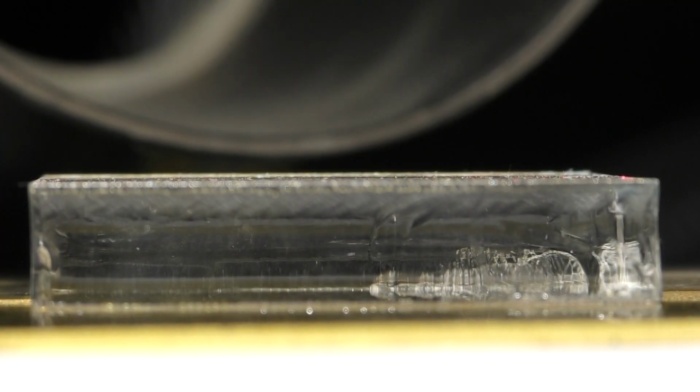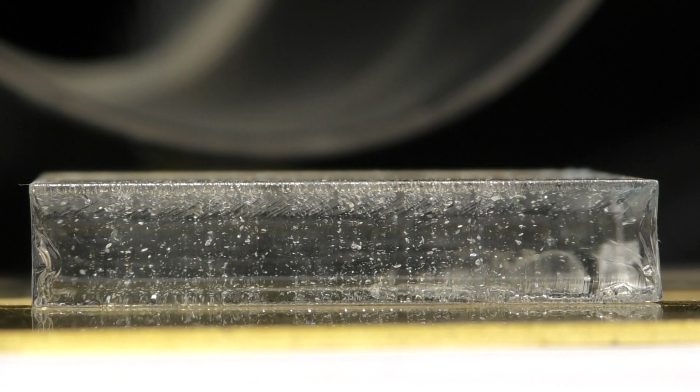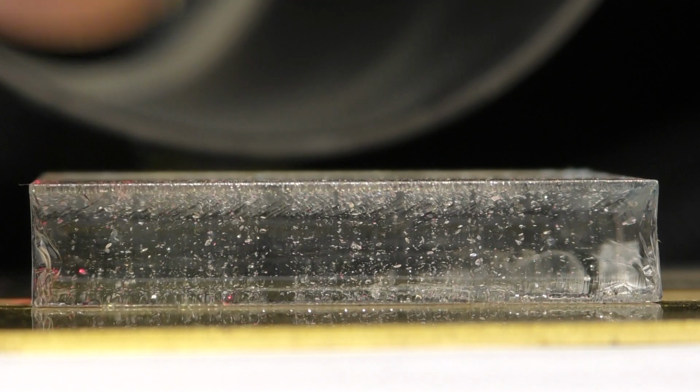Right, well, let's give this a try, shall we? This is 1500mm a second, 75 kilohertz, 45 nanosecond pulse, and we've got a 0.01 interval between the line scans. So we're 4.5 into the material. Now, as you can see, that looks pretty uniform. Although we've got some density at the top, we've got quite a lot happening down below.